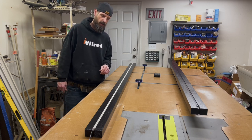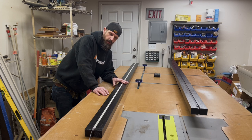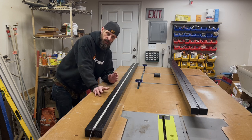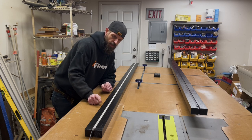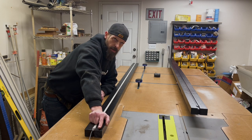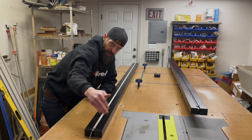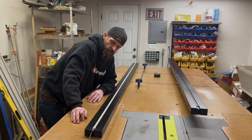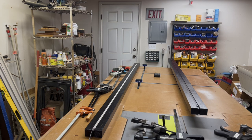Next, we'll get our clamps out and we'll lay out our bunk covers before we put on the end caps. It specifically says to do that in the instructions, obviously, so you can trim the excess off of the end here. It's gonna be a half inch overhang. So we'll get it run and then flip it over and we'll make our cut to give enough room for that to fit up to the end cap real nice and tight.